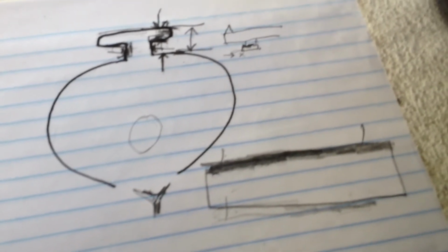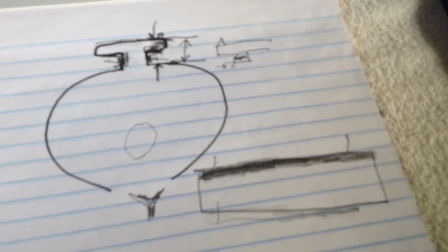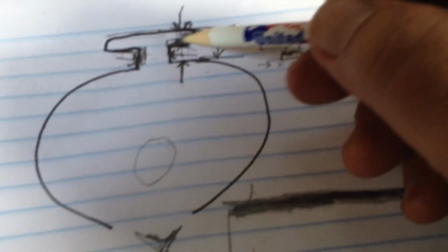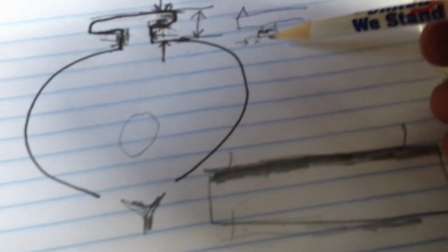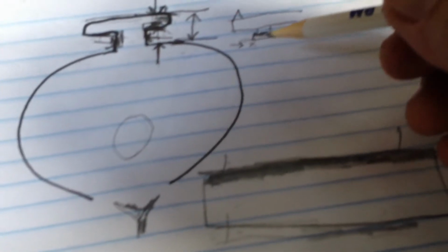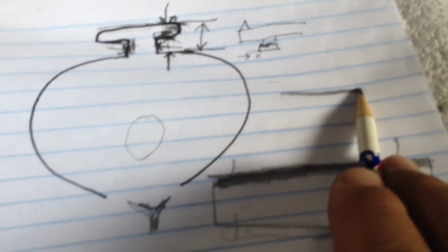Anyway, any further problems there, Rock Base, you can respond here if you have any questions, and I should be able to help. But that should do it. Just remember the key words are: follow where I told you to take it off, very, very little at a time. And keep it even. You don't want to butcher it. Take it off nice and easy, nice and smooth, with a nice even line where you're taking it off. Don't just grind the crap out of it and make it all rough. A little at a time, and keep fitting it.